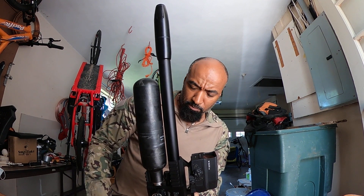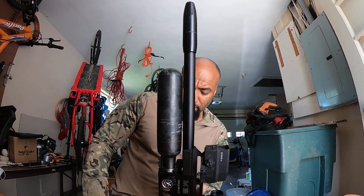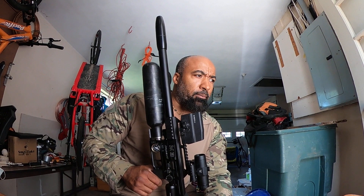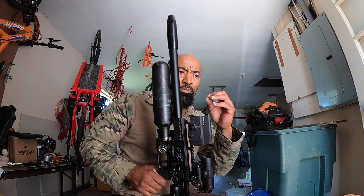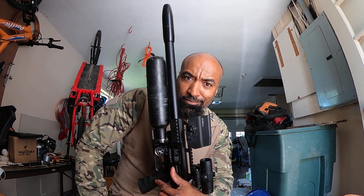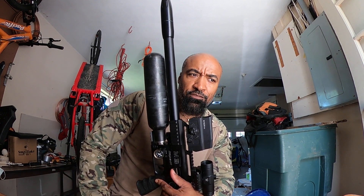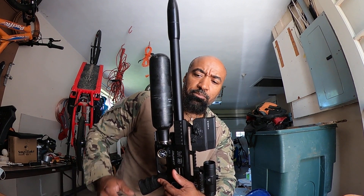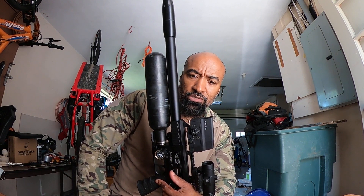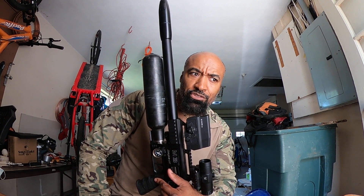This gun doesn't have a lot of metal parts — the barrel is not even metal — so I shouldn't have to worry about too much rust since almost everything is aluminum. But I'm sure there are some metal parts in here getting that corrosive water. It can cause pitting in your barrel. I hate that with my brand new gun, but I caught it fast enough to know not to use that pump to pump this up anymore. If I can dry it out quickly I shouldn't get any damage, but if I had to use it like that for months, I'd have corrosion going through the gun.